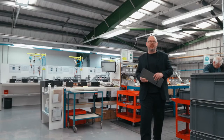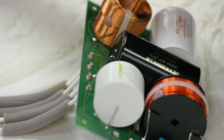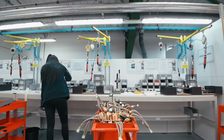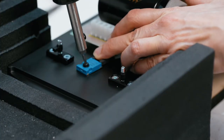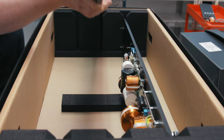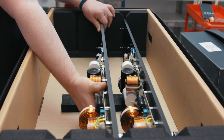What we do here is take all of the high quality capacitors, resistors, and other component parts that go into our crossovers and assemble them exclusively by hand — everything is hand soldered. Each individual completed board is tested, and then the whole thing is put together onto the crossover spine. That whole assembly is then tested again before it's packed and taken down to the final product assembly line.